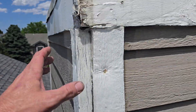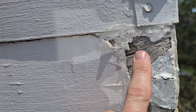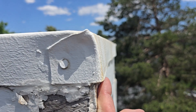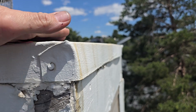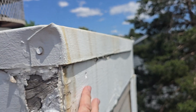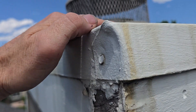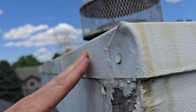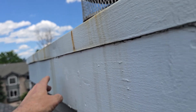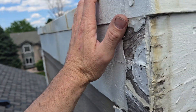They've probably used the wrong building materials here if it's absorbing water. This is real wood — I don't know if the camera's picking up the grain, but that's real wood. Now let's talk about the edge of this and where I found the water to be coming in. This is just a cheap piece of sheet metal folded over, nailed in the corner. You'd think that's okay because it's putting all the water on the outside of the structure — that's its job. However, a chase cover, ideally constructed, should come over and kick out for a three-eighths drip lip so that this sheeting doesn't sheet down the wall and test every joint in this wooden structure.